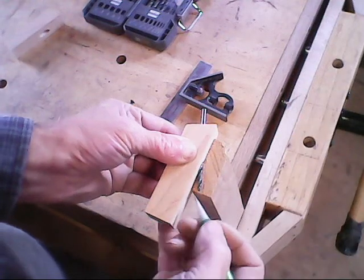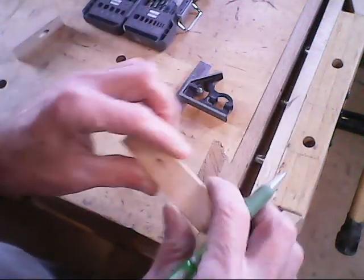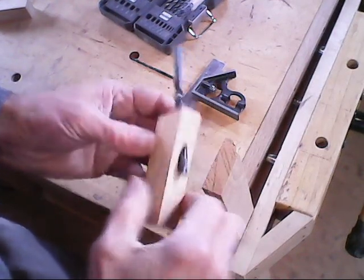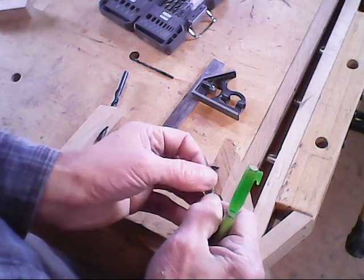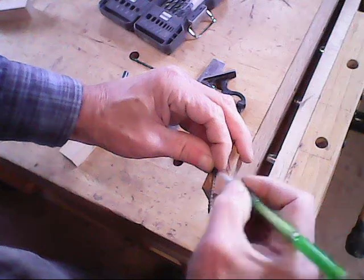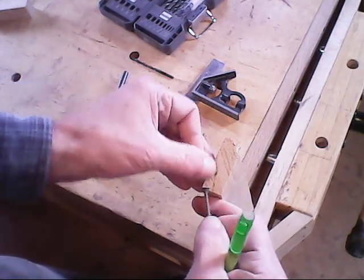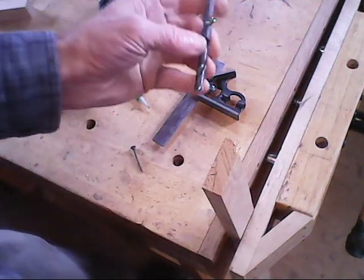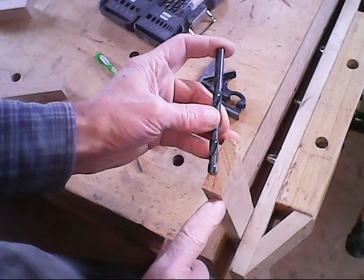I need to line up the second block, and this will be for the head of the screw being countersunk. The first thing we want to do is mark where the center or where the head of that screw is going to be countersunk inside. Then I'm going to take the flute of the screw — the bottom part, which is the bell part of the screw — that's the actual countersink right there. The head is right here at this mark. Down here is where the actual drill bit is going to stop at. I have a 21/64-inch bit that I use for that. I'm going to come down to the second line with my point of my drill and just come down a little bit past there.